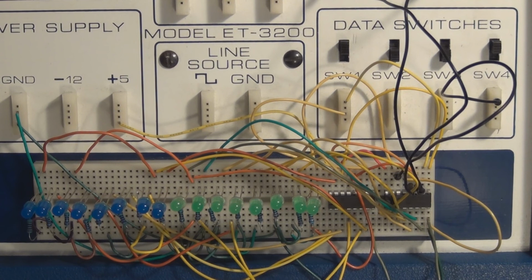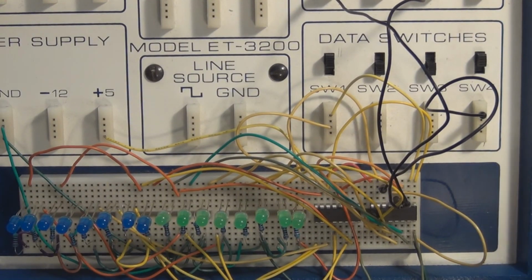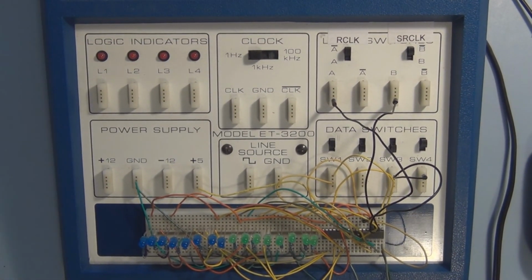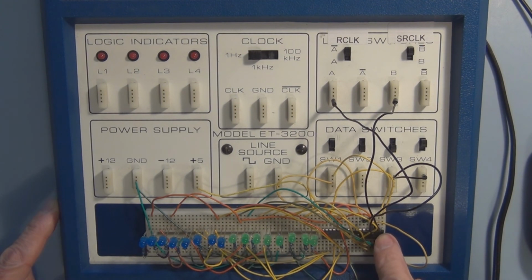Here's an example with the Arduino. If you're using shiftOut, someone has taken the time to put together a function that's going to handle 8 bits, or a byte of information, at a time and shift them for you behind the scenes into the shift register. This here is the basic level where each individual bit gives you the ability to shift them. This gives you the ability to shift them individually into the shift register and out to the LEDs to give you a better appreciation of what's going on behind the scenes compared to upper level programming with the sketch and the Arduino.